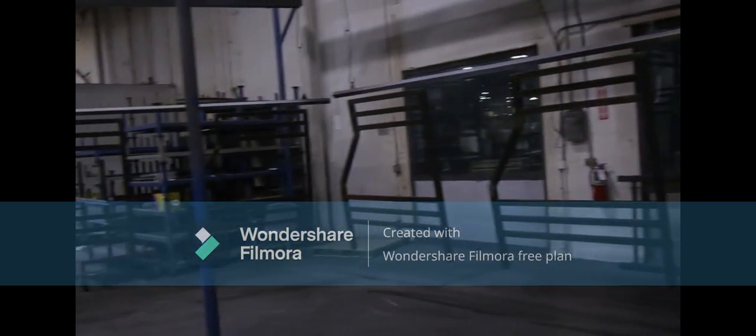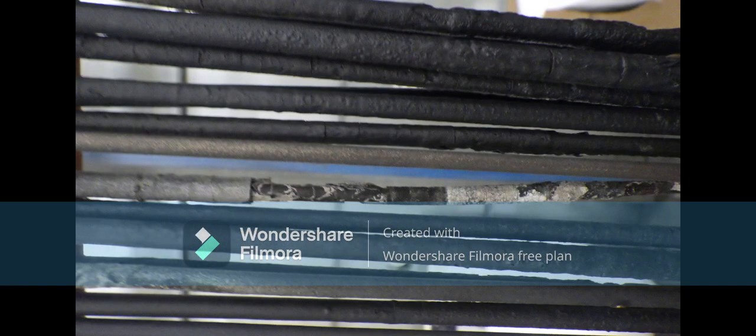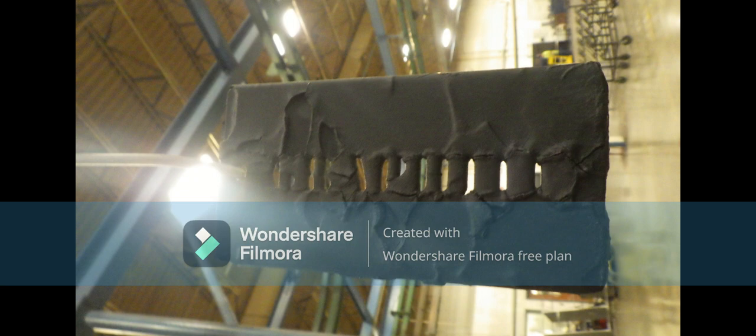The line is grounded, the load bars are connected to the line, the hooks are connected to the load bars, and the parts are hanging from the hook. When paint, cured powder, or any other pollutants collect on load bars or hooks as they go through the line, it increases the resistance, often totally insulating the item, which prevents any electric flow.